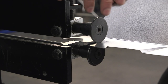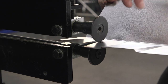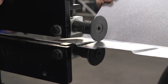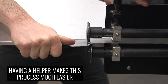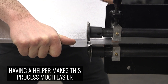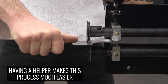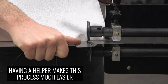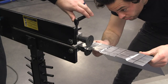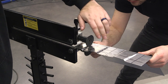As you can see, that worked just great. If you go slow and keep everything consistent, you can feather out your beads back to flat. Counting your turns and being super consistent is very important here. I dialed in about two and a half to three turns after we touched the material, and I had three inches of bead to travel across. Some simple math states that if I pull out a turn on the bead roller for each inch of travel, I'll move back to flat by the end of those three inches of travel. Pretty simple.